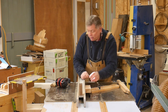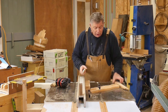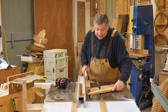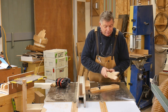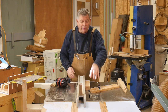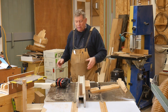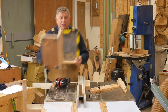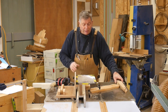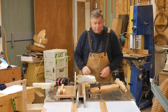Because there's nothing else to push at the back, I'm going to use two push sticks — one to push it forward, and then at the end of the cut, because I don't want to be reaching over the blade, I'm going to keep it pushed in at this end until it's well clear of the blade. I've removed my overhead guard because it really gets in the way when you're using short pieces and a feather board. So I'm going to use my standalone guard which has got magnets on the bottom — that allows me to see what I'm doing and use my push sticks, but it stops me doing anything stupid.